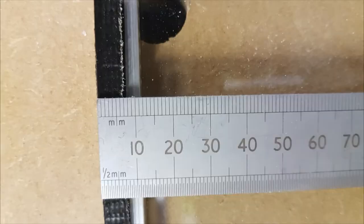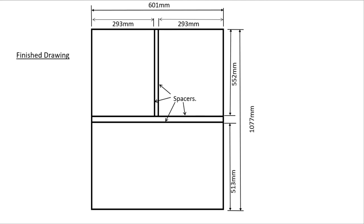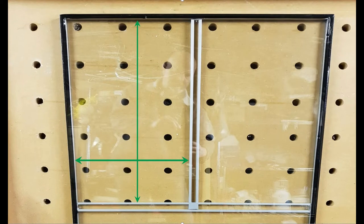You need to work out the widths of the separator bars — in this case it is 12 millimetres. Then add those 12 millimetres to your overall dimensions, so the width will be increased by 24mm as will the height, but the dimension to the muntins will be 12 millimetres. Your finished drawing will look like this, and I suggest this is what you take to your glazier. This is what will make your window frame look exactly like it was made originally using double glazed units, with the inside dimensions you took matching what you see here.